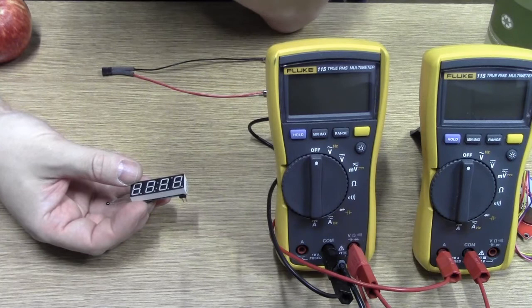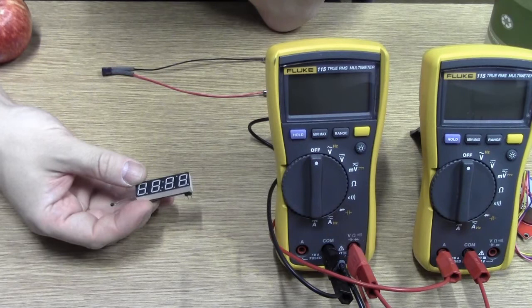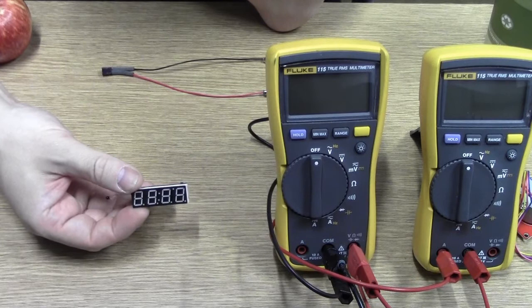So we'll measure that, make sure it doesn't go over the 40 milliamp range. I've got my power supply current limit set to 40 milliamps, so if it does go above that, it will start kicking in. Voltage resolution 2.9 millivolts. Well, yeah, we'll check that out and all the measure voltage ranges and stuff. So let's plug this in and power up.